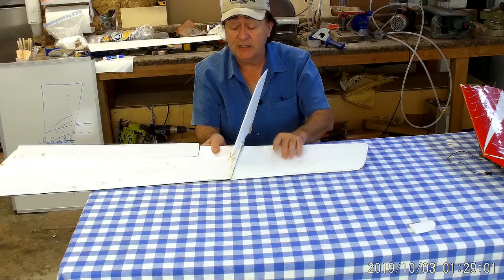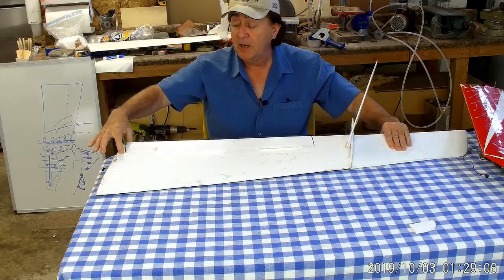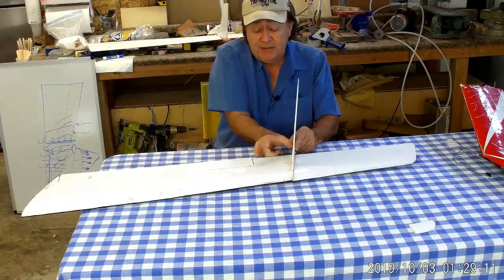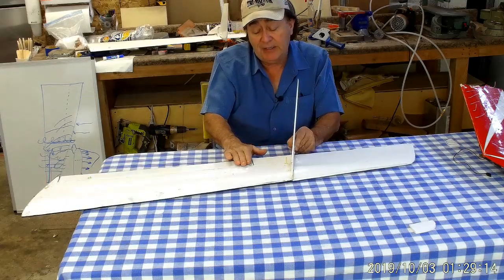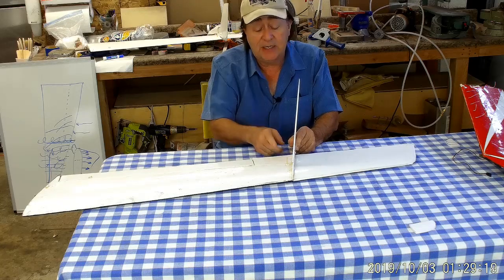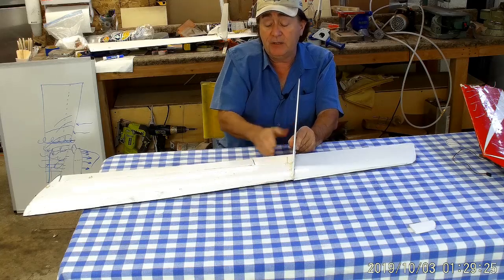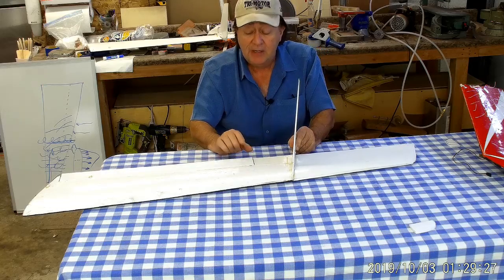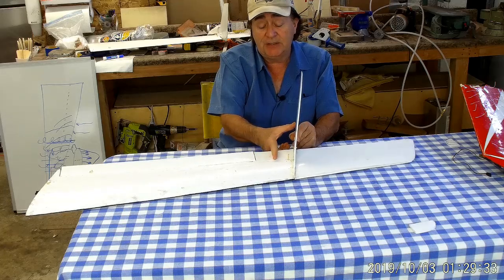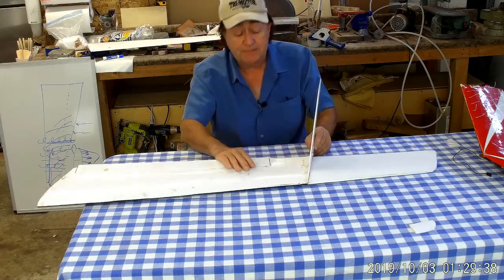That design factor has been locked in, and the control surface is inboard. And I've actually extended the elevon much further inboard to get more control effectiveness. And I've left this gap here. Actually, at one point, I had the elevon running all the way out here to the winglet, and I decided to go back to having this open space here to keep the flow going straight and put the elevon a little bit inboard on that. Now, this elevon turned out to be not quite effective enough, and I think I would go back and I would just cut this space in half. You really don't need much space here to keep that flow going straight.